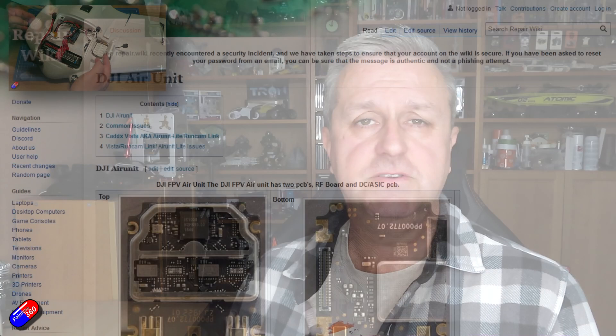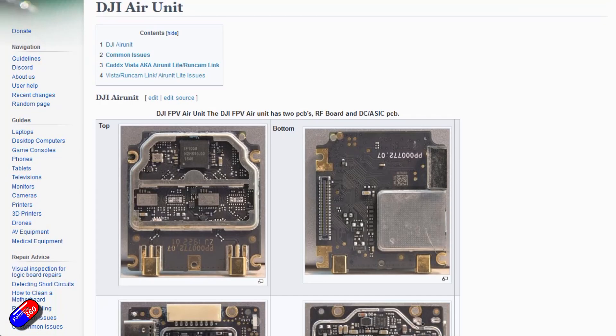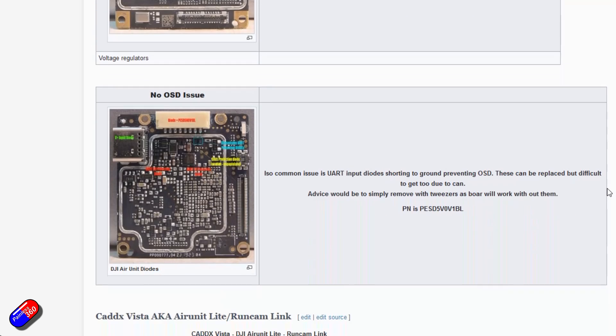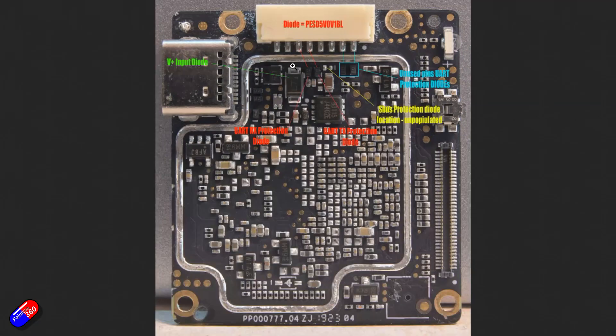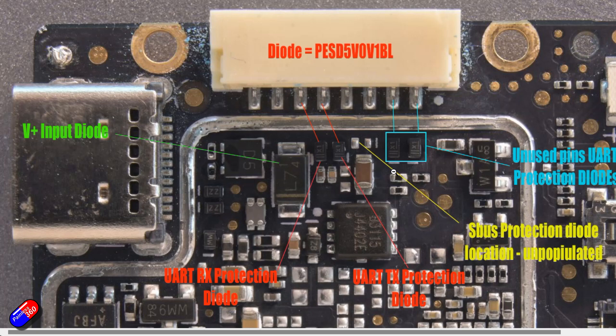Thinking about it, that's a really good idea, because the issue I had with that particular build was that I got dragged into the issue with the DJI HD FPV system losing the ability to display the on-screen display. Thank you very much to somebody who sent me the link showing the diode that's probably broken in that air unit — the one that stops the UART working so the on-screen display stops. You can remove that diode and everything goes back to working. I'll put a link below. But I got completely distracted and went down that rabbit hole and forgot to do the basics.